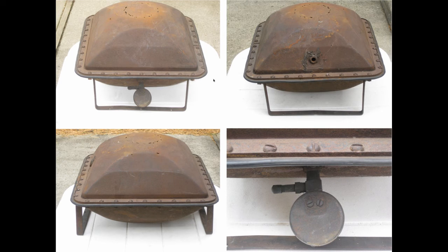They gave me this. They made this out of 2 street lamp blanks, and they put a rubber diaphragm in between, and they hung them from a basement ceiling. Here you see it's upside down, but that proved the concept that you could trap air on one side and water on the other. And as they began to make these tanks in the early days, they didn't have a Schrader valve on there, but they used a chunk of dry ice. They put the dry ice on the air charge side, and it would of course evaporate and put carbon dioxide in there, and they knew how much dry ice to use to create a 12-pound pressure inside the tank.